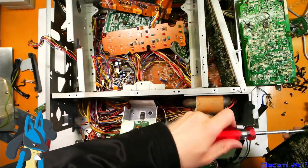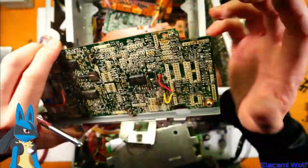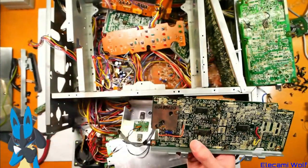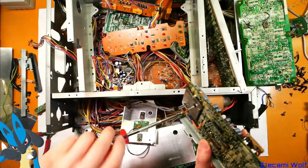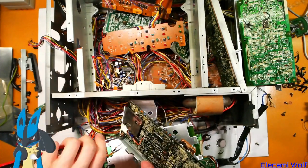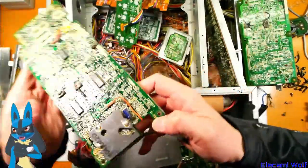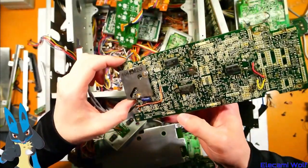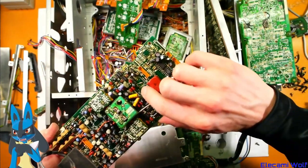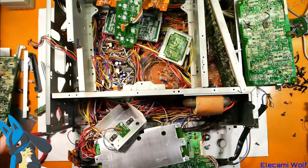I wonder if there's a ground plane — would this be a multi-layer board? You can see another piece of metal work with a part number on it, and the little drawing showing the signal coming out of the shield with the shield also grounded. This is an NEC branded board, so I guess they manufactured the blank boards. I can see dark bits in the board where caps on the other side have leaked and started wrecking it. There are also filters — a filter can thing with a conductor in it and a slug going through it.